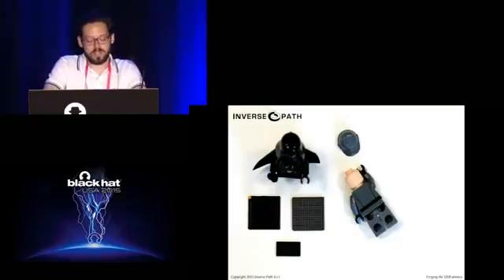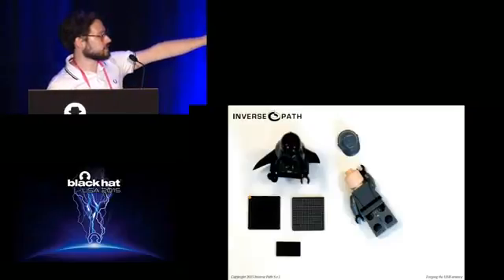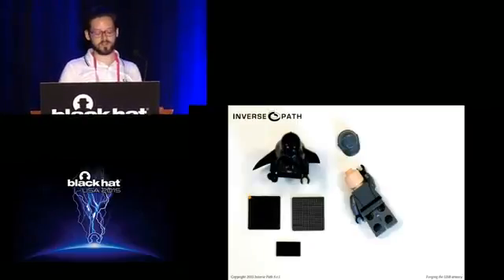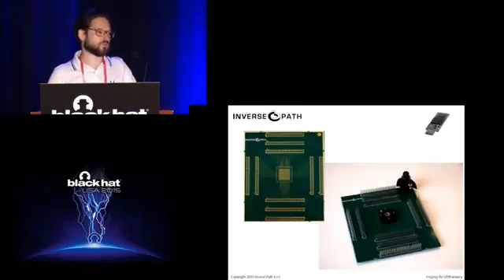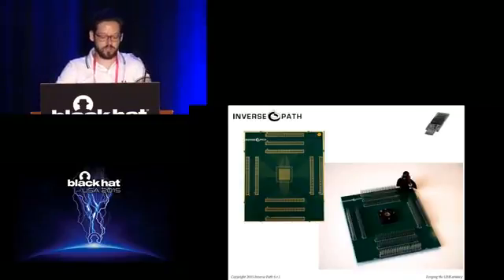What were the challenges in developing this hardware? First, it's not something you can easily prototype and solder by hand, because there are two components with a BGA — ball grid array — form factor. The SOC and the DDR RAM module have 529 tiny balls soldered to the board, which is very difficult to do by hand. We tried to be smart and made a breakout board with an expensive adapter that clamps the SOC without actually soldering it, breaking out every single connection for debugging. You just screw everything with a precision torque screwdriver, and it works.